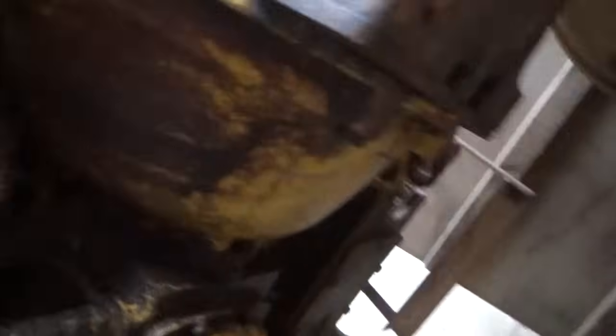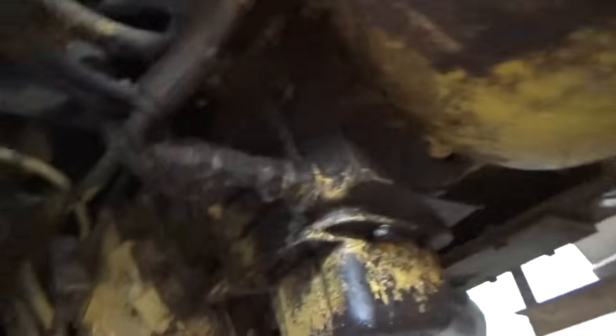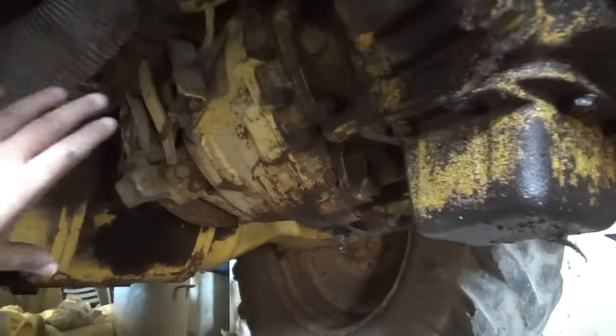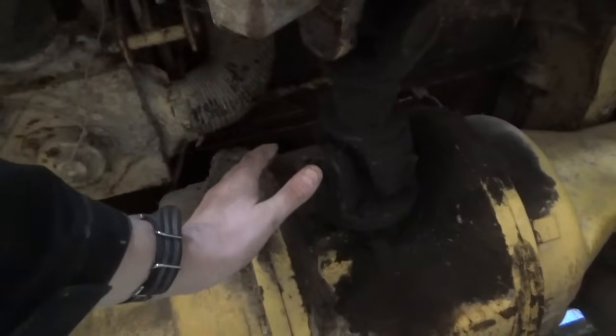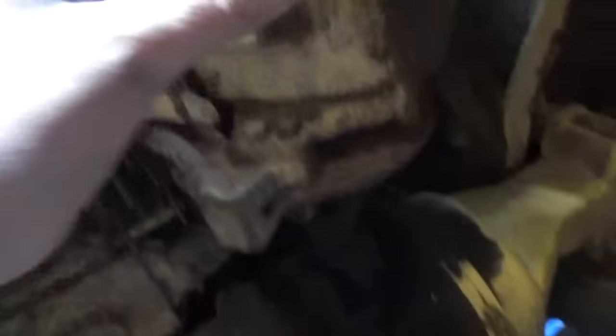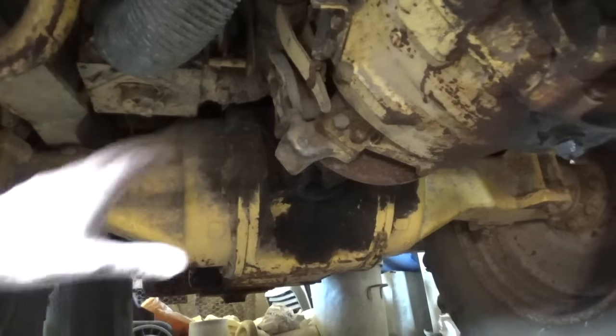So you've got the sump - there's your engine, starter motor there, there's the bell housing, and that's where the actual torque converter unit is - the fluid flywheel. Then here is the powertrain transmission. It's not part of the whole unit like on tractors. And then you can see there's a drive shaft - it doesn't all connect right through to the back end like on an old Nuffield or a Leyland tractor. You've got a separate prop shaft there. There's your transmission brake. And then there's the back axle. So as I said, this is the whole thing about the three systems: you've got the engine, the powertrain transmission, and the back axle. It's very similar to this even to this day with JCB and most wheel loaders - that's the system you'll have.